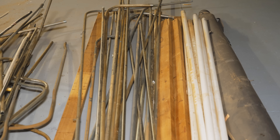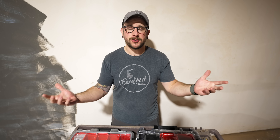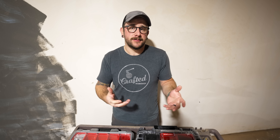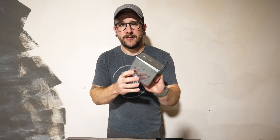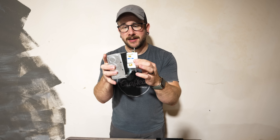This is the wall where I'm going to start my electrical work. I need to paint this wall, so I figured I'd install the conduit first using salvaged conduit from when I pulled out all the old electrical — it's a little dingy but I can paint it to make it look nice and tidy. This building is technically zoned mixed use but I'm treating everything as commercial, so I'm going to be using commercial grade materials. For outlet boxes I'm using 1900 boxes — four inches by four inches with good depth to fit things like GFCI outlets.